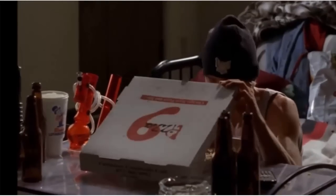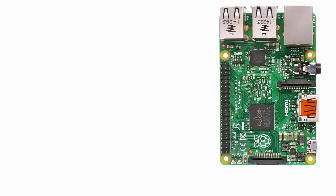Star Trek script? Yeah — I gotta write it down is all! So what to put on the board? Start with the Raspberry Pi it connects to. Then there's the Lattice Ice40 FPGA, naturally. Then add an SPI flash for standalone operation when this thing isn't connected to the Pi. Add some SPI connections from the GPIO so the Pi can program the FPGA or the SPI flash.